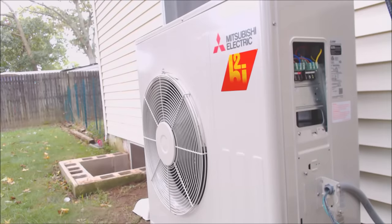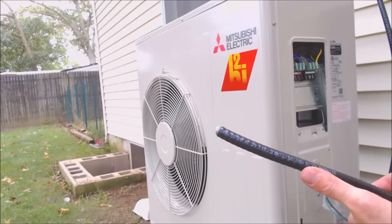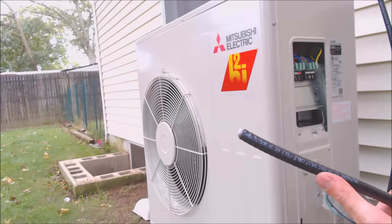The reason for that is you have a small section that's exposed outside. You have high voltage wires inside as well as your low voltage communication wire heading into the indoor unit, and that needs to be shielded when it's outside and exposed like that.